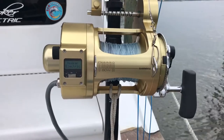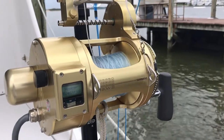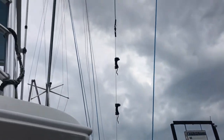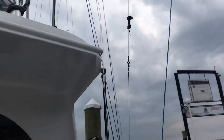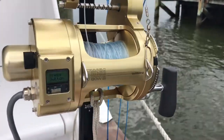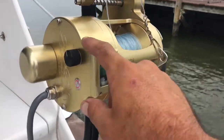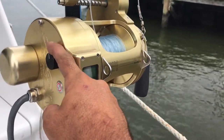Here's your 80-wide Tiagra Hooker electric dredge reel. We've got 250-pound mono on there, raked up to the outriggers on the pulley system. Yesterday we were testing it out and it pulled the three-tier 48 mullet dredge no problem. It's got variable speed so you can reel it in slower or faster.